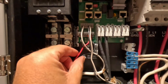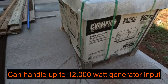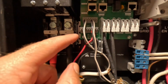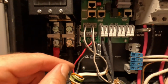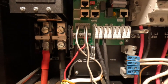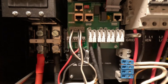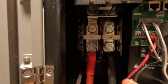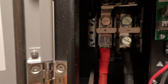The Solark has a two-wire generator start, and we have not set up the generator — I've purchased it and got it sitting out there, but haven't set it up yet. It's also got a spot for battery temperature monitoring. My batteries have their own battery monitoring system, the BMS, with their own shutdown for heat and cold, which should never be a problem in here. And then this is where my battery connects — once the sun goes down, you've got to run off something, and this is where the batteries come in.